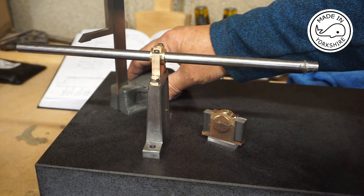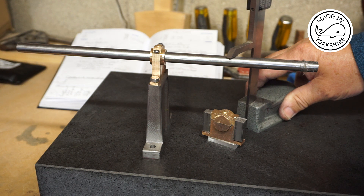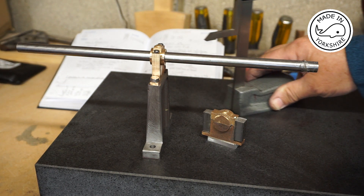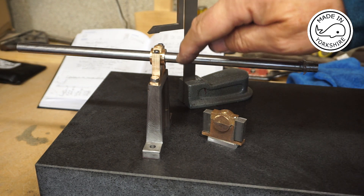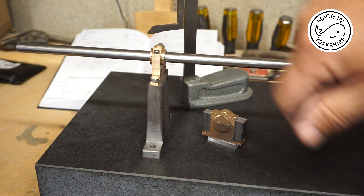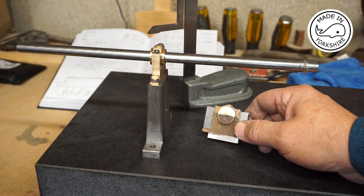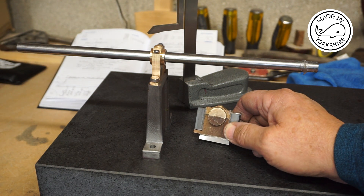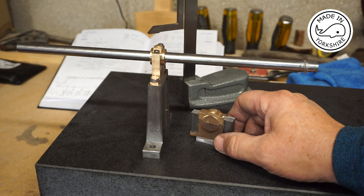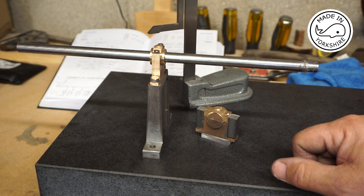I think I managed to recover the situation - I've just put a bar through the bearing and it's spot on, so I'm happy with that. Unfortunately the only negative thing is the width of the bearing is slightly narrower than specification, but anyway I'll carry on and finish off the other bearing, and hopefully this time I'll be able to clock it properly on the lathe. I'll do it all off camera as it's exactly the same process.